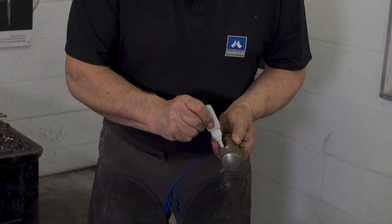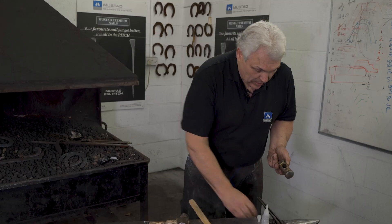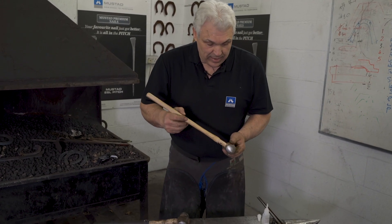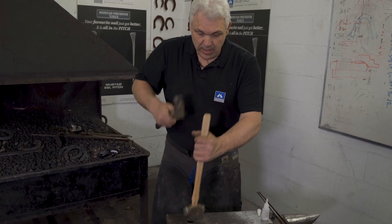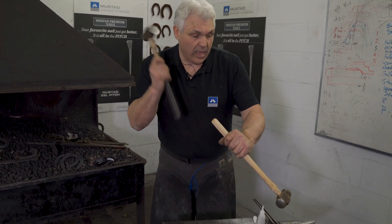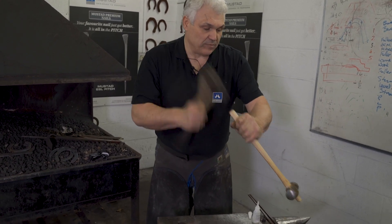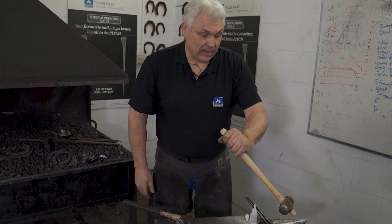I like to put some glue into the eye of my hammer. On the entry side I put the handle in, I'll snug it in just to get it to stick a little bit, then I'll drop it in through. We don't tend to get as much damage into the handle — we just push the handle into the head.